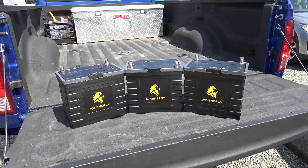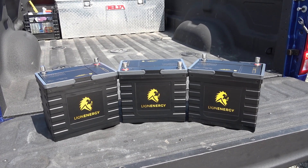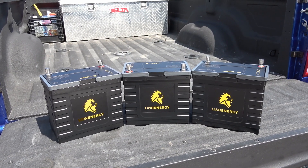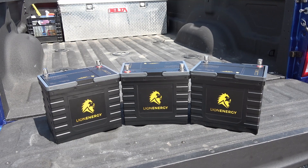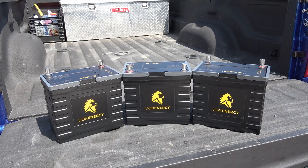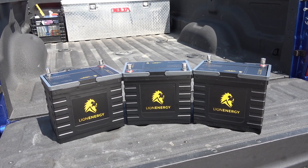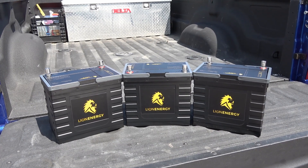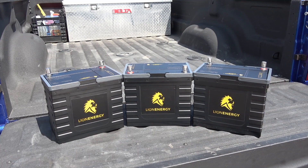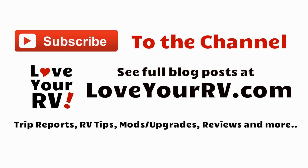So there are the discharge tests. As we pulled more amps out of it, we got fewer amp hours — from close to 90 amp hours at low drain, which matches the rating, all the way down to close to 80 amp hours at the full 150 amp draw. Still not too bad. Check out the link in the description for part two, where I'll do charging tests and a comparison with my lead acid batteries.